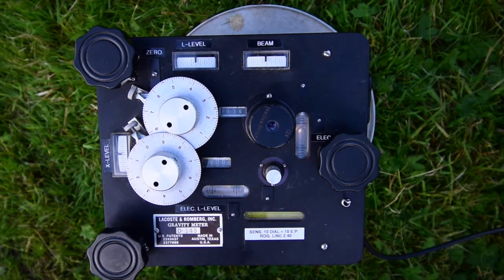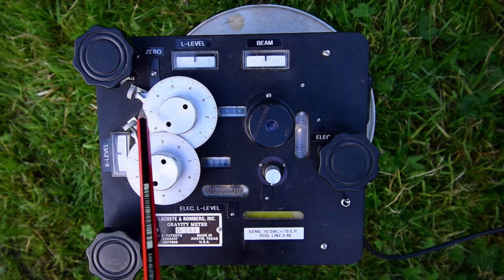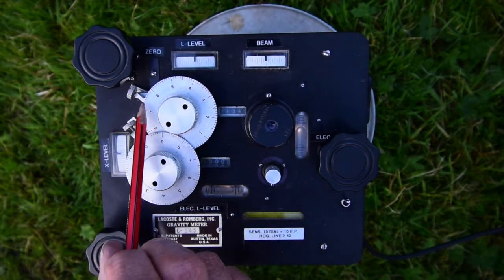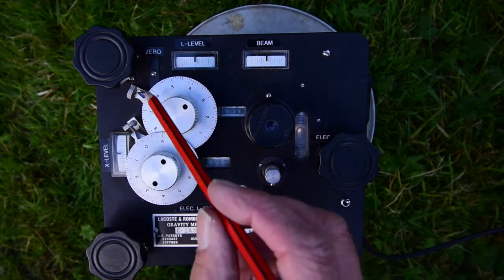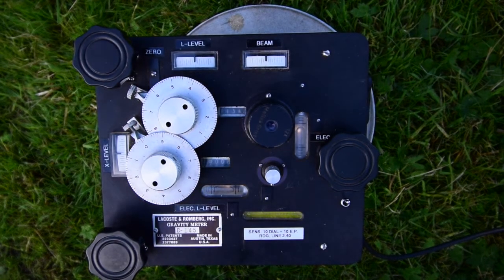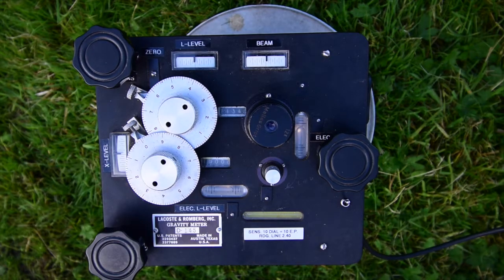The fifth digit in here, it's like the last digit on your gas meter. You never write it down. That's because it's tenths of a dial turn, and it's better to read the tenths off the dial itself. And you can see that's 4 tenths, 5 tenths, 6 tenths. So this is between 0.6 and 0.7 dial turns. To get the next digit, we count these little divisions. So this is 0.65, because that pointer is very near that 5. And we estimate a third digit by estimating how many tenths of these tiny divisions we're at. Now, as it happens right now, the pointer is dead on one of those divisions, so I would write the answer down as 7134.650.